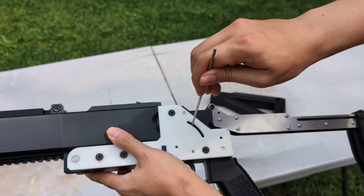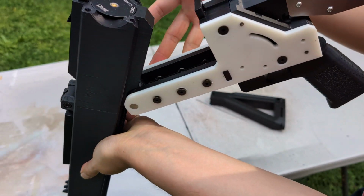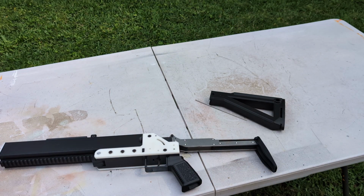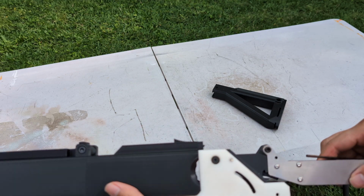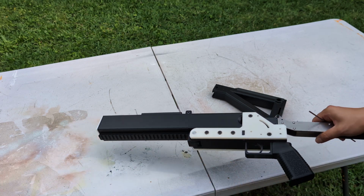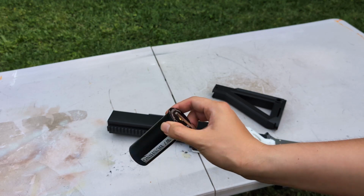Then you need to cock the hammer again, open the barrel and extract the shell. Close the hammer again. On the NT79 3D printed launcher, the automatic cocking lever has a problem where if you trim the firing pin too much, it will not reliably ignite the primer. And if you leave the firing pin too long, it will dig into the primer, so you will have difficulties opening up the barrel after you fire a round.